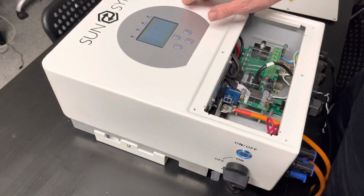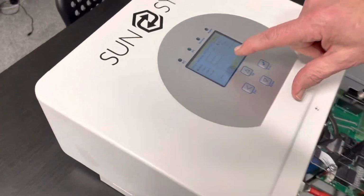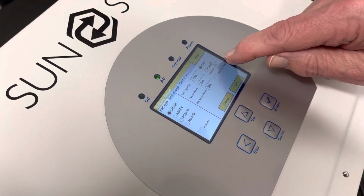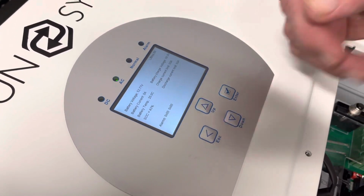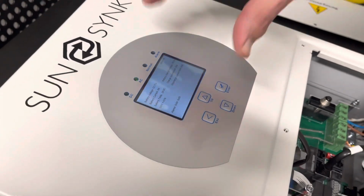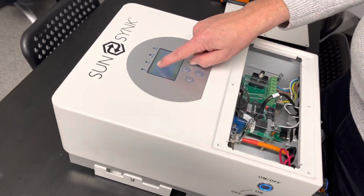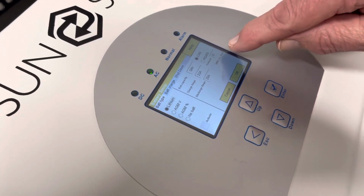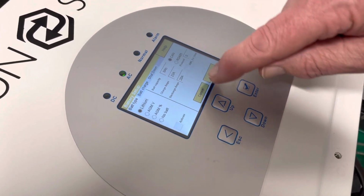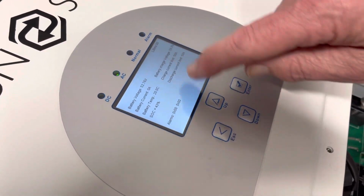Look at the settings on the inverter. Go to battery, we select lithium, we select 0, we select CAN, we press OK. We go on to lithium ion and you'll see the figures here. If you don't see that, with this very simple check, battery, lithium, you can see the setting here: CAN, 0, okay. Check on here, check the fittings.